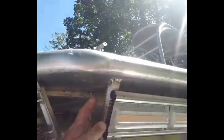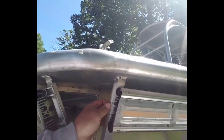So first off, you want to make sure that your lights are properly mounted and solid. As you see, I've made a good solid frame with these so they're not loose, vibrating, bouncing down the road. Hopefully my trailer will take some of the vibration, but mounting a light solid will keep the road rash off of them. Driving on the highway and across rough water will absolutely beat the living crap out of your lights, and that's something that you really want to take into consideration. Let's climb up in here, and I'm going to show you how I wired Miss Lizzie.